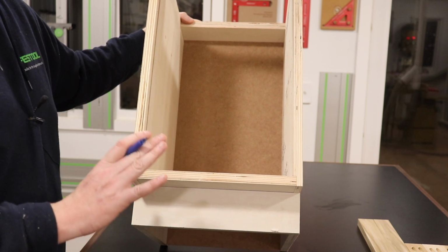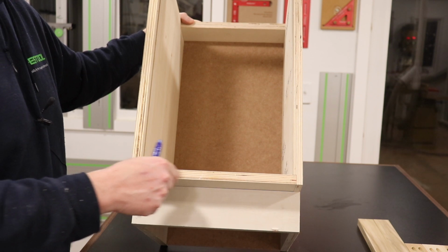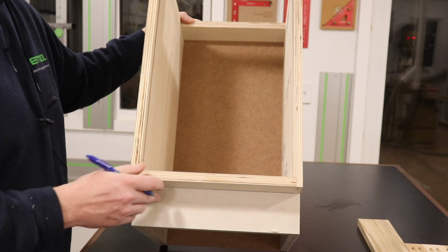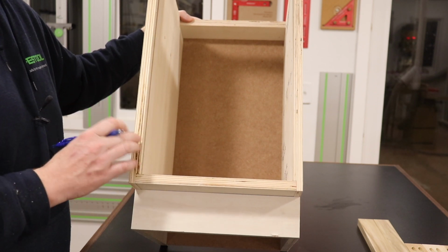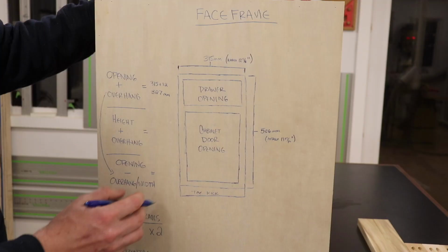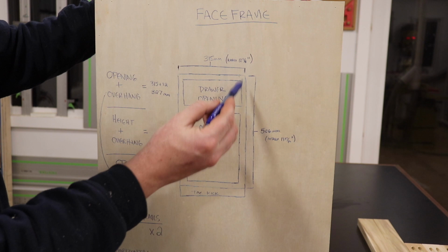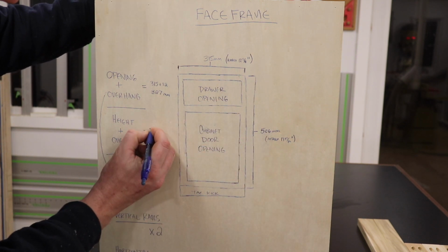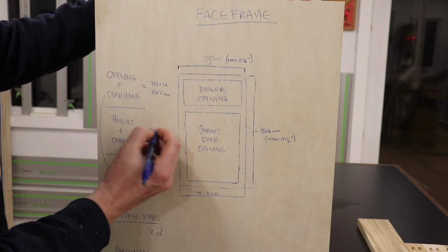What I'm going to do today for this video is simply have it overhang down on the bottom by about 6 millimeters or 1/4 of an inch. And then on the top, it will be roughly the height of a piece of 3/4 inch plywood. Now, I know my height for the front of my cabinet, not including the toe kick, is 506 millimeters or roughly 19 15/16.